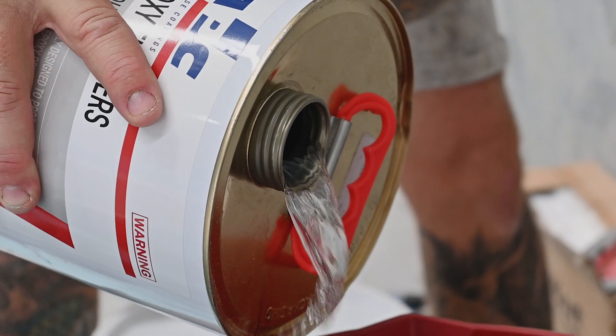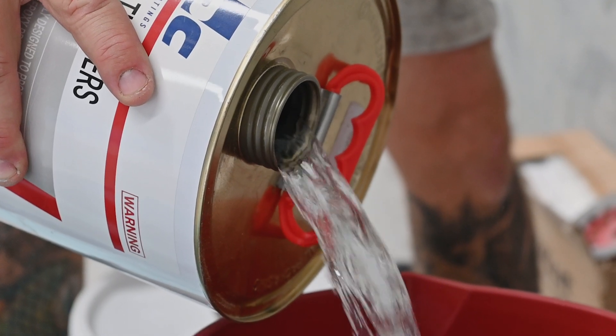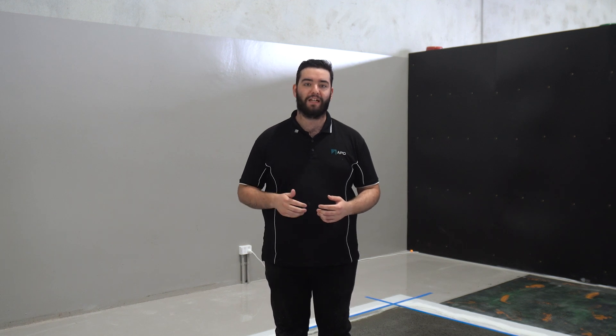For hard, dense concrete, a heavy grind with a recommendation of 20 to 25% APC thinners for your prime coat. Concrete with a densifier or guard present requires a heavy grind with 16 to 25 grit super soft diamonds to get a key. Then perform another water test after grinding and proceed based on those results.